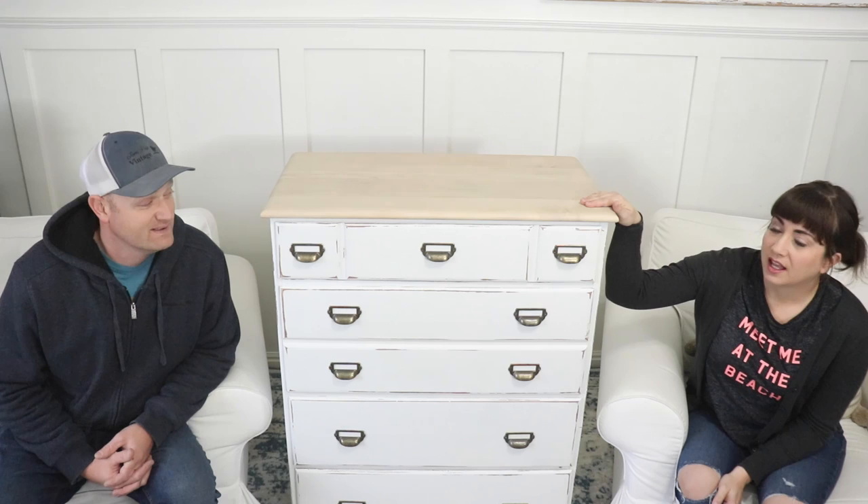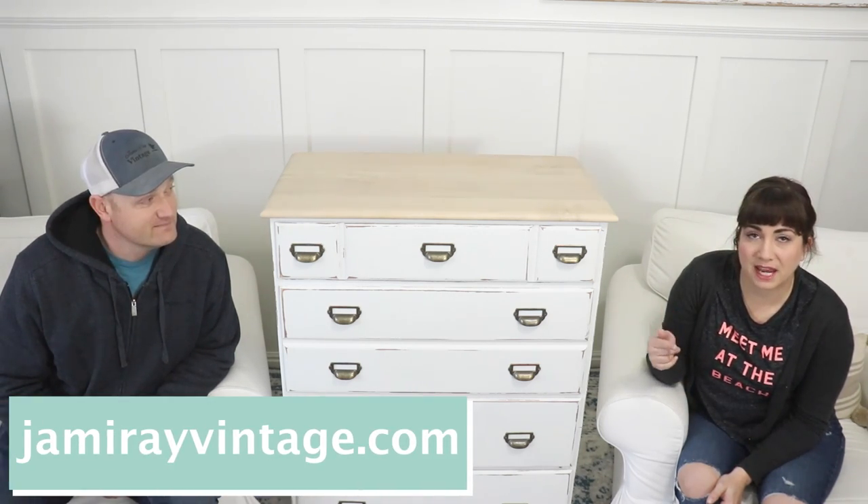I know this is a look we've done a lot, but this is the first time we've done a bleach top and I think it turned out amazing. Lighter woods are really coming into trend right now. Sometimes it's hard because woods tend to lean yellow and orange, and the bleach really helped neutralize that. All I did was sand it, spray it with bleach, and walk away until it was dry, then spray it again — just kept repeating that process. We ended up with four coats of bleach, and then to neutralize it, just wiped it off with a damp rag. Be sure to go to jamierayvintage.com if you want to use the paint and top coat we used. The top coat gives it a nice matte finish without being too shiny. Be sure to give us a thumbs up and subscribe to Jamie Ray Vintage for more DIY.